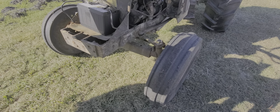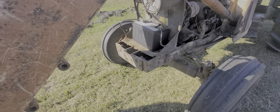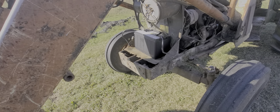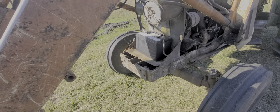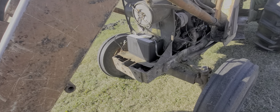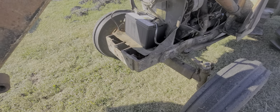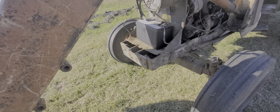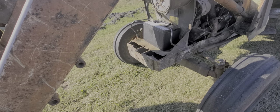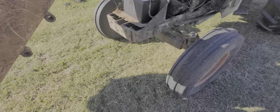So it all needs a rebuild. On the other one, the bed for the key was absolutely destroyed. A piece of metal, probably about an inch and a half, was torn away from the bed. It's like a lot of flesh of the metal was torn away. Crazy. So I welded it all up, ground it, and made it all new, the bed for the key and stuff like that. It worked out awesome. This one needs a similar thing, but that's the simple part, doing stuff like this, or fixing the bucket, that's the simple part.